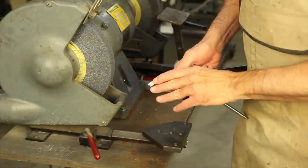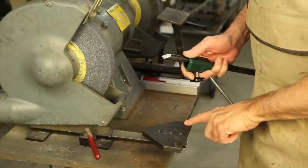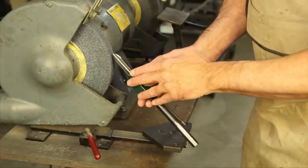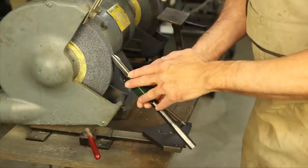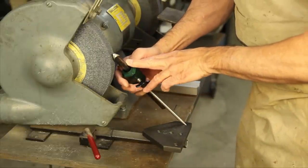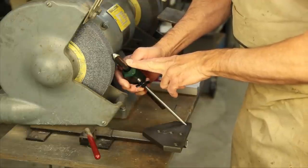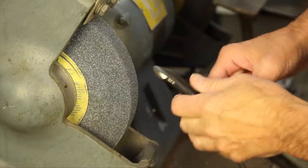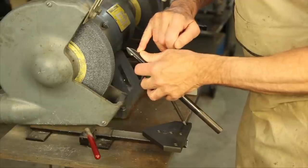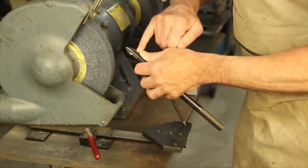To make the primary or rubbing bevel grind with the vector system, you use the left and right holes. For the right side, the right hole, the left side, the left hole. And you start just a little bit beyond center and come around like this, and you have to go all the way down like this. And so it's useful to take the handle off the tool if possible with this fixture. What that does is it actually makes this edge curved, and it completely eliminates this corner right here that has always been something that you can catch on very easily.